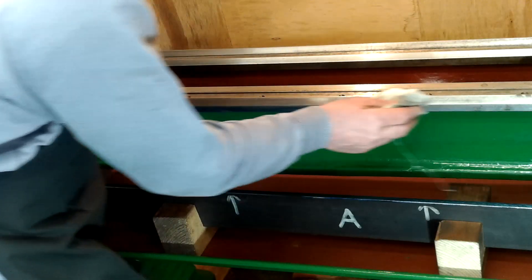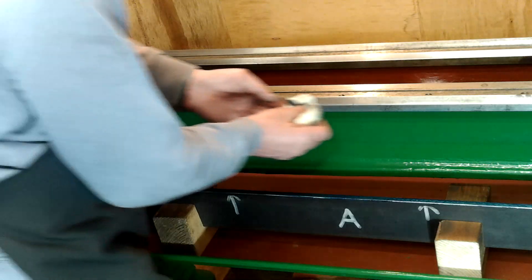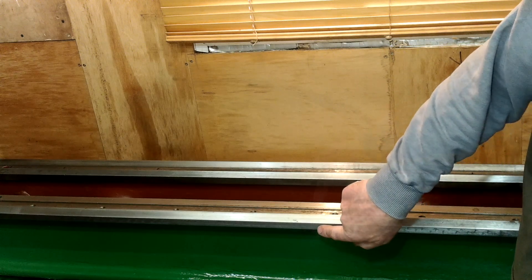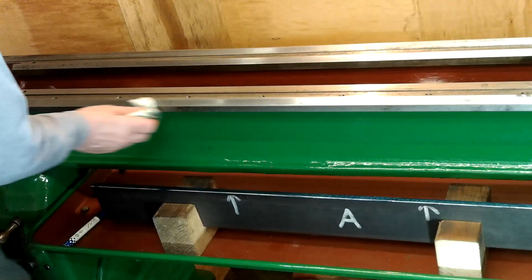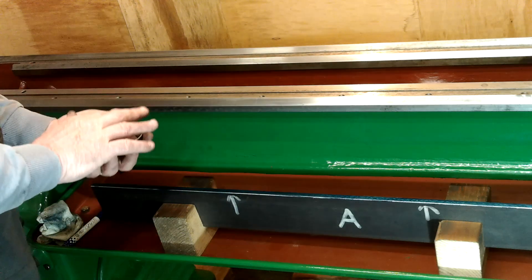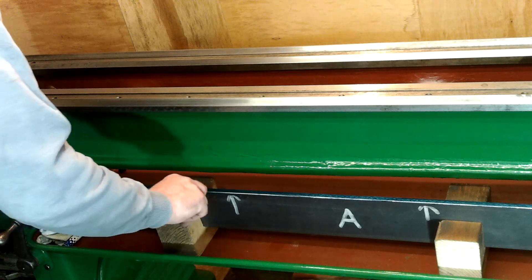The reason for establishing the current condition of each slide is obvious, but what I'm looking for are the best or least worn faces, and I really need three good ones. One must be an under face, one has to be a side face, and the last one has to be a top face. More would be a bonus. The contraption I have in mind will rely on a minimum of three true faces to get the best out of any error should they exist. I'll explain about the contraption when I make it, but for now I have to map out what I've got.